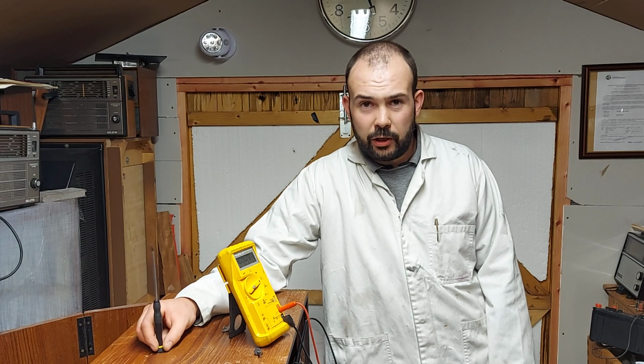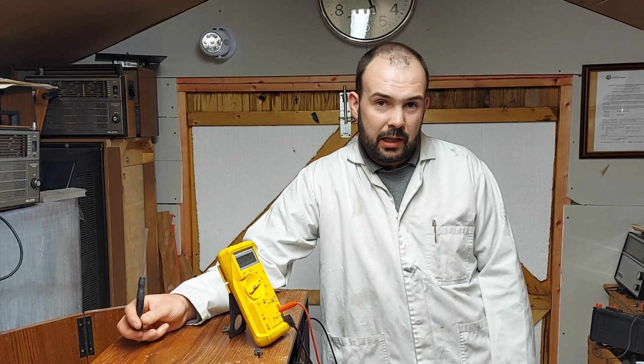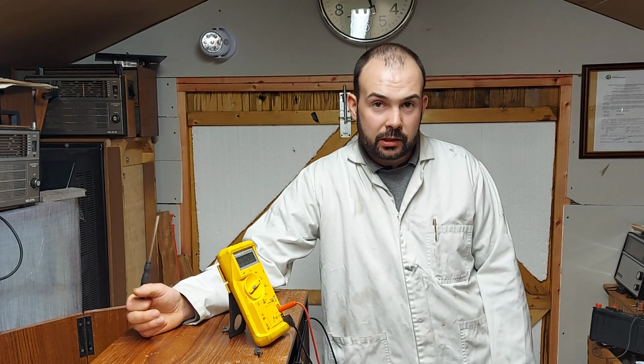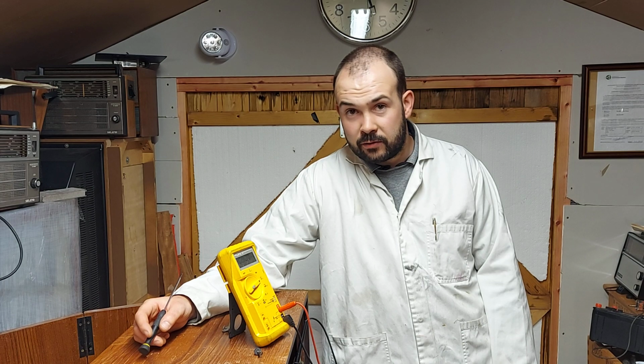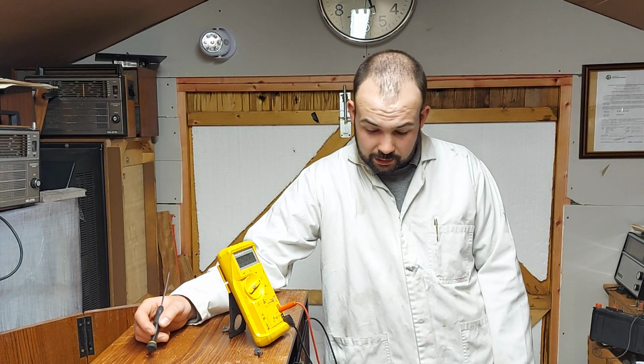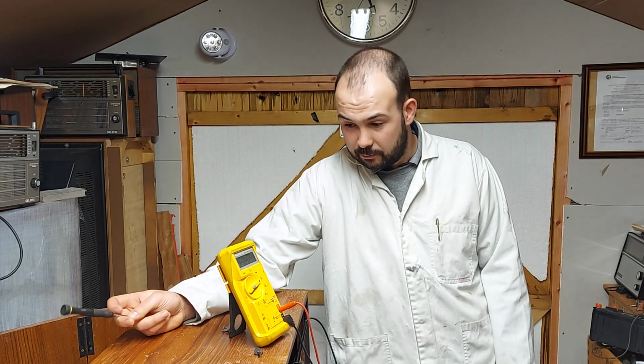the damp gets into the windings. They're only covered in a sort of a pitch, wax, tar, and it's hygroscopic, so it soaks in the water. So it just helps. It gives the line output transformer a fighting chance if you dry them out this way. I didn't come up with this idea. People a lot smarter than me did.